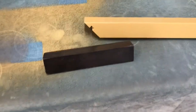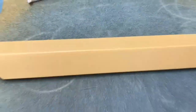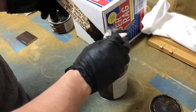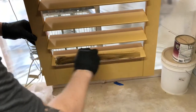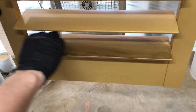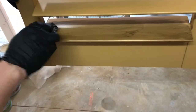Now you can see how the frame of the shutters is going to have to be faux finished to look — it has more of a blotchy pattern and not so much of a graining pattern. For the shutters themselves, there's going to be a lot of graining done in multiple layers. What I've decided to do is go ahead and tone the shutter down a little bit to give it some more gradation and unevenness with some dark walnut. This is going to help the natural look we're trying to achieve in an unnatural process.